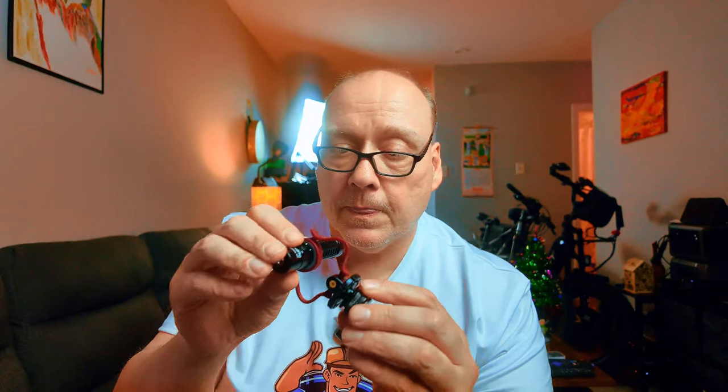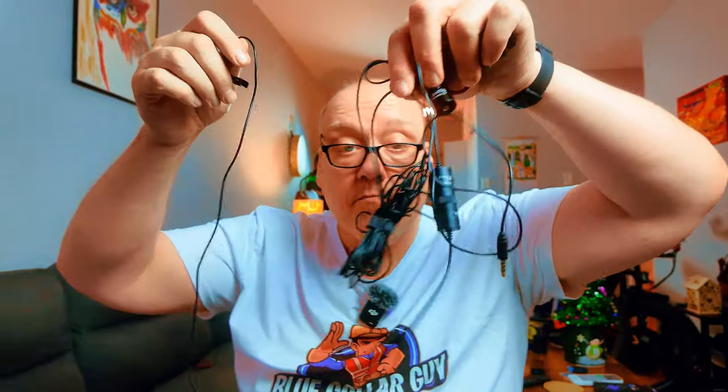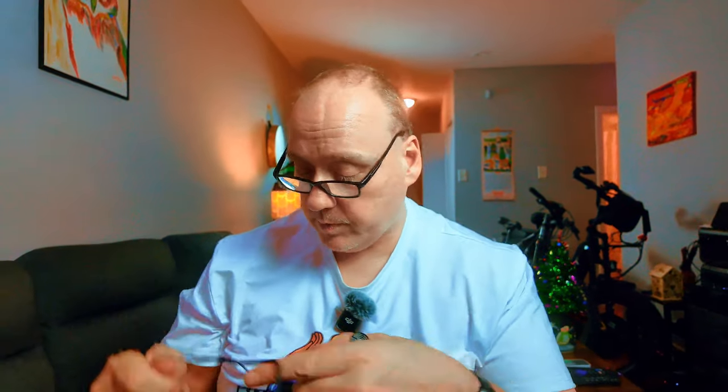The Boya lavalier microphone has a big cable with a little built-in amplifier box, making it more of a condenser mic. Because it has an amplifier, it'll get your levels up much better and may sound a little more clear. However, the amplifier can introduce noise in the form of buzzing or hissing.